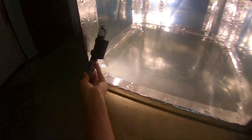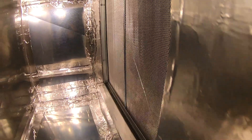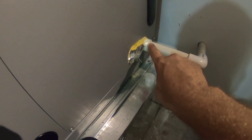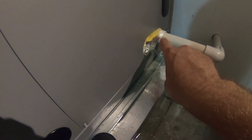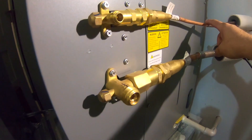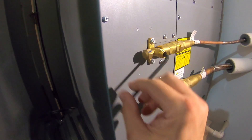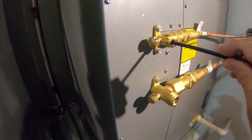As you come into the air box and look up, you can see the underside of the air handler itself. We attached our drain line to the pan at the bottom of the air handler for condensation, and that line goes to a sump. We attached both refrigerant lines — these are our quick connect lines. The last step is to take an Allen wrench — it was an 8mm on one and a 5mm on the other — and open up the valves to release the refrigerant, both on the outside and on the inside, backing the valve all the way out.